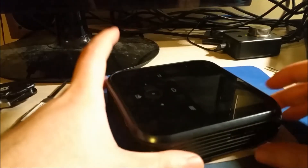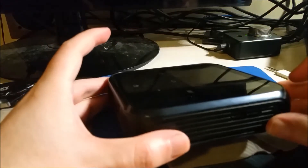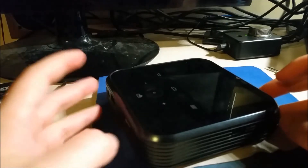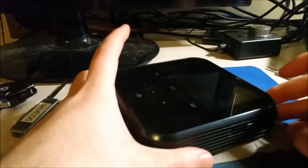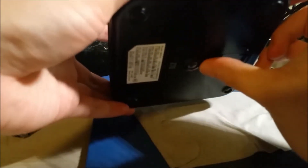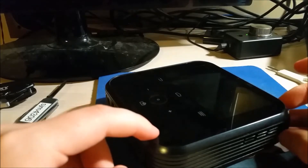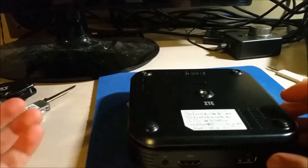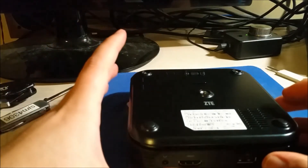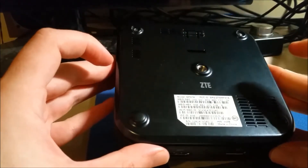Hey there YouTube, this is SGM4306, and this is a bit of an impromptu video. I wasn't planning on making a video today, but I went to use this projector and I usually just leave it plugged in because the battery lasts only about an hour anyway, and it reduces the brightness. I noticed today that the bottom was bulging out quite a bit, which is a really bad sign — that means the internal lithium battery is failing. I figured I pretty much never want to use this on battery, so I might put a small token battery in so that if you unplug it accidentally it doesn't shut off the projector. I don't need a huge 5,000 mAh battery that's just cooking all the time and could possibly fail.